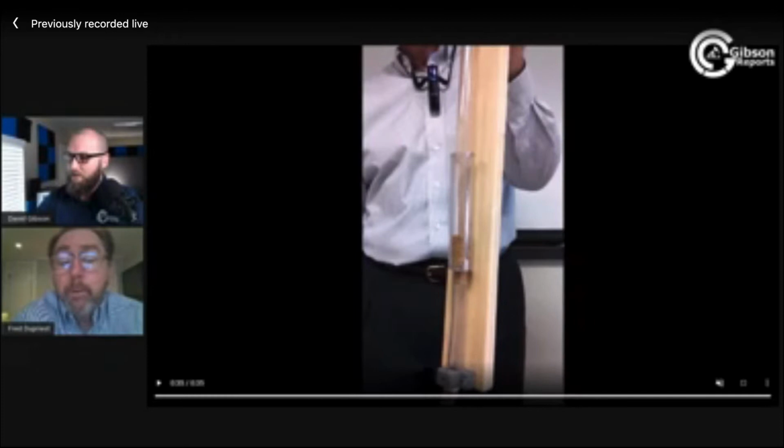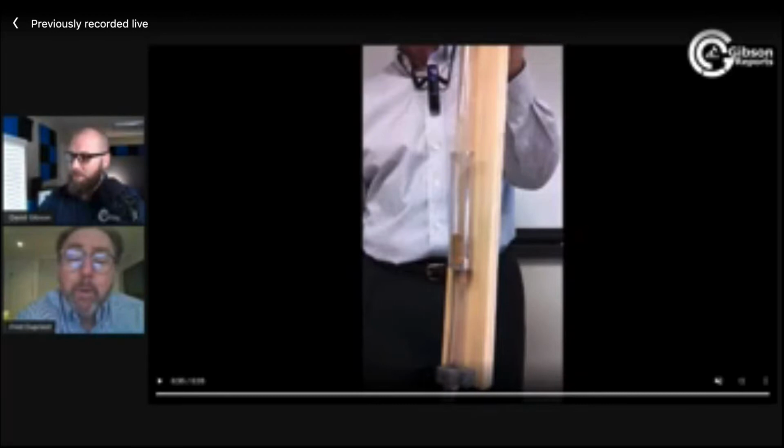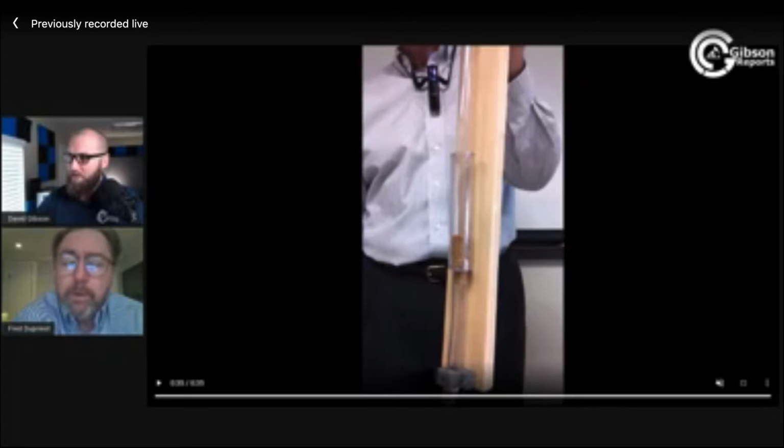If you bring your pump rate on, say, really fast, you might pressure energize it, wedge lock it into the borehole wall, and now it's got strength, and now you're actually stuck. But most of our drillers are pretty good about their practices, bringing things on slowly. So that's not the most likely thing to see. The other diagnostic you'll see is that you'll trip out of hole and you'll come back in with casing or whatever, and you find a bridge. That's not a hole cleaning indicator. That is a borehole instability enlarged hole indicator. And that's the way you should think about it.